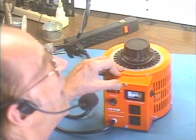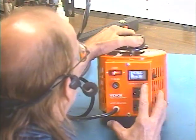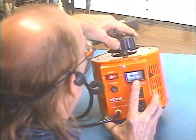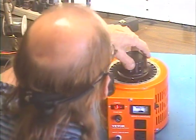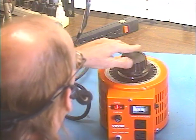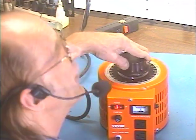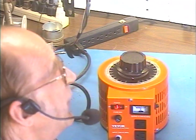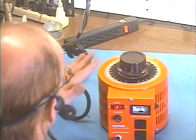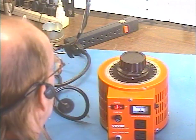Just to give you a general idea, I'm going to turn it on. Right now I've got the voltage set to minimum, and you might see the meter come up as I raise the voltage. See, that meter is slowly coming up. This will actually go a little bit over line voltage — it's designed to take in 120 volts, or most people call it 110, and it's adjustable up to 130. So you want to be careful not to over-adjust it. These can also be used for light dimming. Anything that requires you to reduce your AC voltage coming out of the wall can be handled by this — AC motors and things like that will respond.